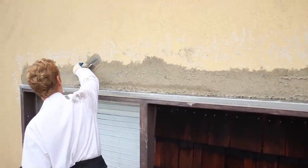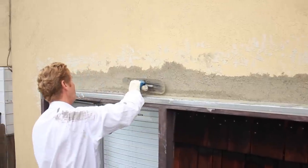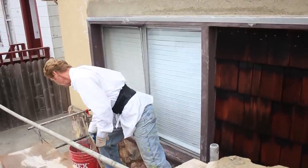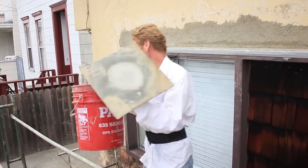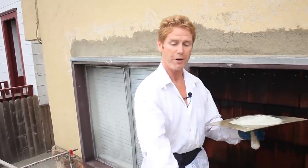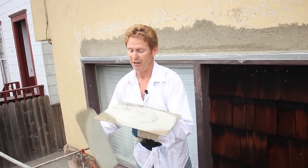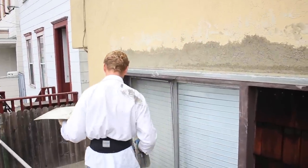The proper material I'm using on this is a Lahabra 2030 — that's the technical name — and it's for a fine color coat finish. Jay already mixed some up in the bucket here, and that's about all I need. I'll pull it out now. I just cleaned this hawk with water, so it'll slip and slide all over the place, so I do this to level out the playing field so when I pull the material off it's not sliding too much. Alright, now we start again.